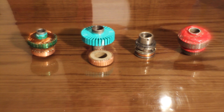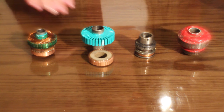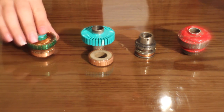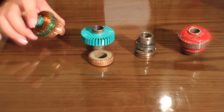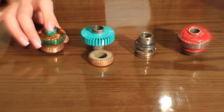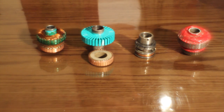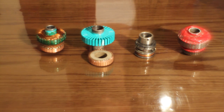You can see how small they really are. The next steps are to take the winding data, strip the windings, re-insulate, rewind, reconnect, solder, dip, bake, machine, test and send back to the customer. Each step can take a long time to complete, but that's the process. Luckily here at Ertin Electric we have overcome many of these difficulties and have no problem rewinding these for our customers worldwide.